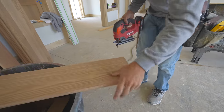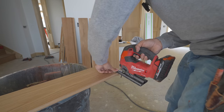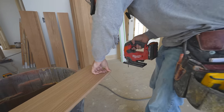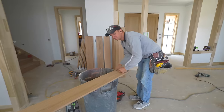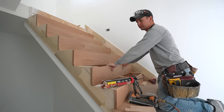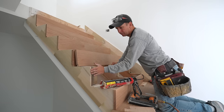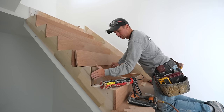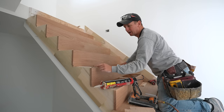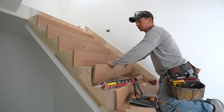After the first cut, I'll flip it over and I can see my pencil line on the back side — this side does not have to be as precise. We've got our notches done on all of the pre-cut risers. Next step is to start nailing the risers in place. We're going to use a lot of PL Premium in this process. With the skirt board bevel cuts, you'll get that nice tight connection back here but there's just a little bit of space because of that bevel to put some adhesive in and get a good connection.